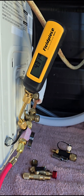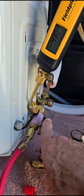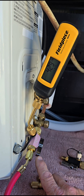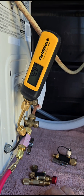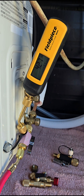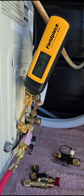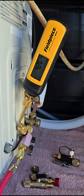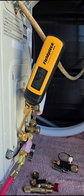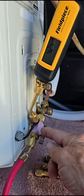It was good to hit that valve and show you that. On that valve — it's just a little T-valve that opens and closes — just on that little valve, it goes enough to go from 419 to 480 microns. So that's a lot of microns. The point I'm making is, you can imagine this thing boiling out any non-condensibles from the system. That's what the vacuum is all about — literally boiling out things like moisture or whatever non-condensibles that will ruin the POE oil. And you can see how fast it went up from 419 to 480 — that little tiny bit of air.